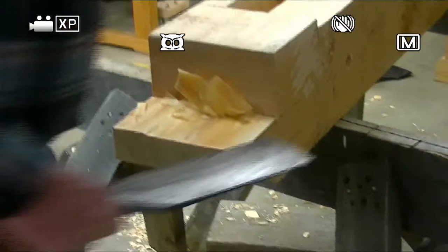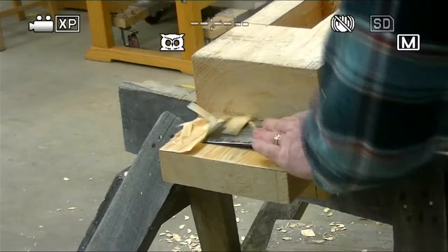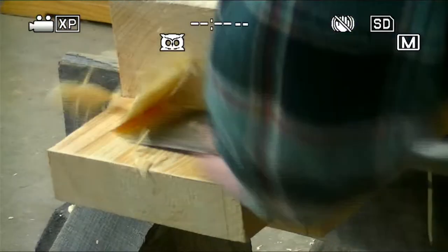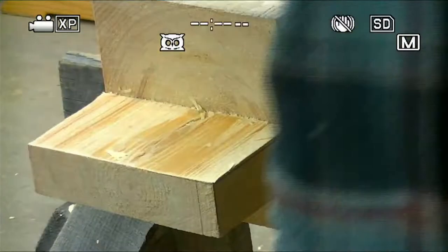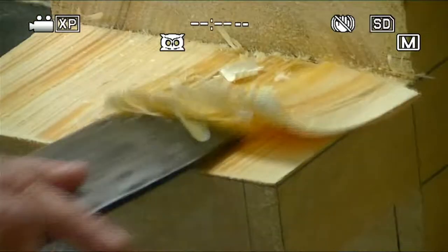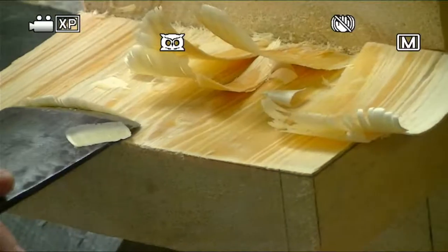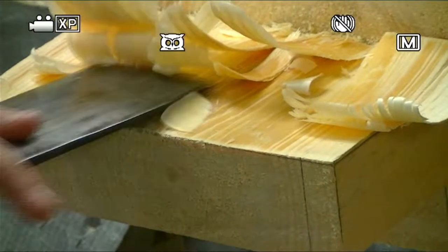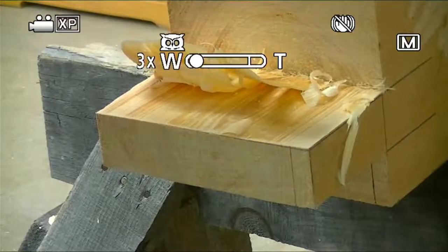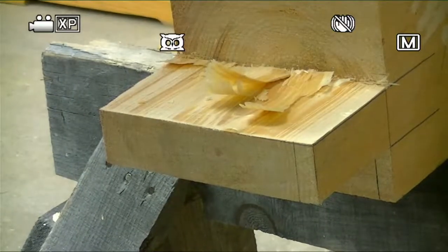Moving to the other side — these chisels are all very sharp. I'm looking at my line here and down here. I'm good along this edge but I've still got quite a bit toward the back, so I need to go get that. What's so critical about it? This has to fit in a two-inch mortise. This is my tenon going in the mortise. This is an example of a mortise up here, and this is the tenon — this particular tenon is simulating the top of a post.